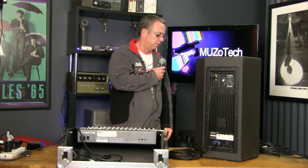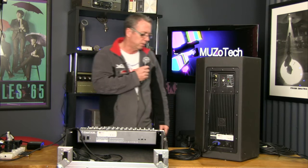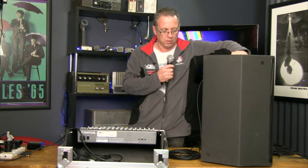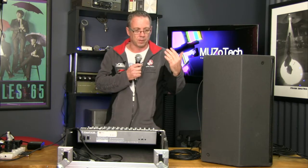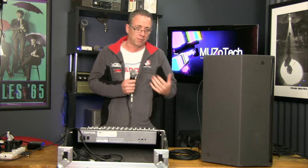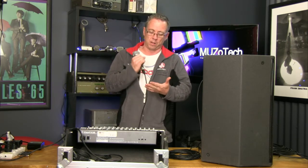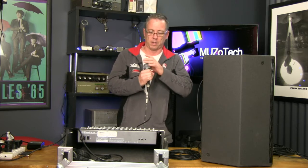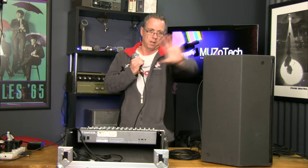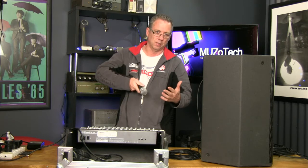Or if you have the speakers in the wrong position so that they're facing back into the mic, the mic can hear the speakers directly. I'll just demonstrate that a little bit without trying to blow your ears out — or mine. If we come around this side of the mic, you can start to hear it getting a little bit squeaky there. That's because the mic is picking up the front of the speaker.